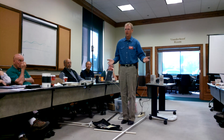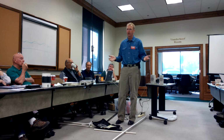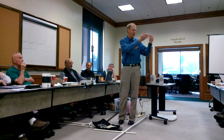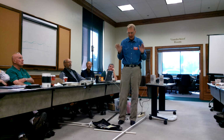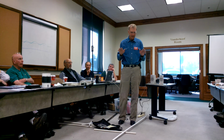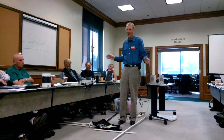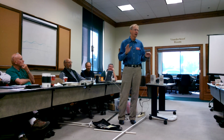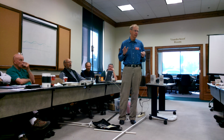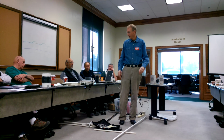Ah, okay. So this is a solution for when I can't leave an antenna up. I don't have a tree, I've got a table outside, but I can't leave an antenna up, or my wife hates antennas. Shiny aluminum, I found this helping a couple guys. Shiny aluminum antennas are not easily accepted by wives. So nothing I'm showing today is shiny or aluminum. Painting shiny aluminum antennas does a world of good for hiding. If you paint them with green camouflage paint, which you can do, it doesn't hurt the antenna. Just don't paint the joints.